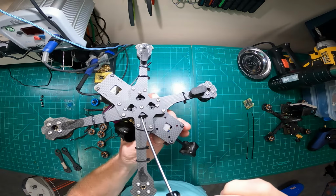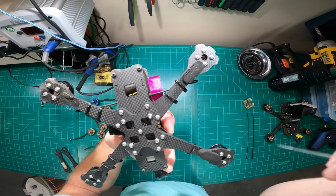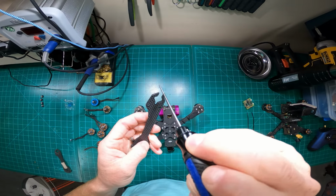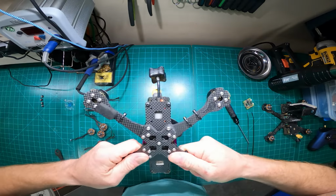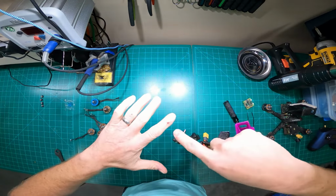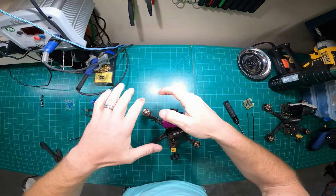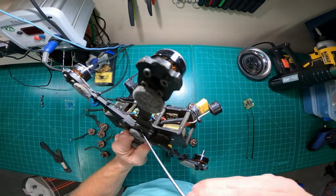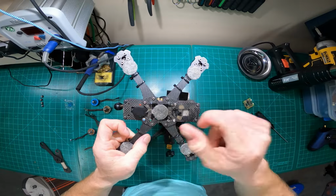Another addition they did was they added this little cross piece here. I don't know if you guys can see it. It's in here. What that does is it fits like a nice little wedge for all 4 arms, and it stabilizes the arms in place and they don't move. So much so that when I was forcing the arms together on it, I overdid it and it busted my knuckles up pretty good. These little points here just jammed in my arm. I got like 3 fingers in one time. But this older frame doesn't have that little carbon cutout in there, and the legs move when they loosen up. So you have to do bolt maintenance a little bit more frequently.